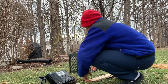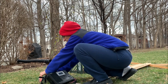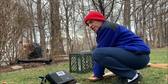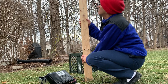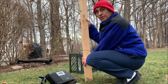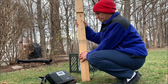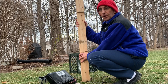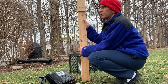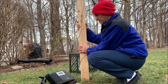We'll go back to the terminated flag again — this is all on 80 meters using a 20 dB preamp. Pointed toward the noise source, rotate around — now we're pointed away from the noise source. We'll continue around the full 360 degrees, back toward the noise source.